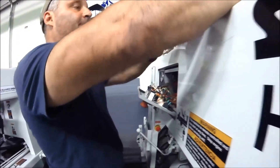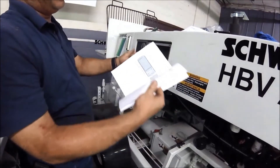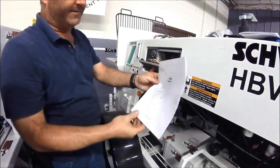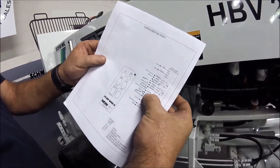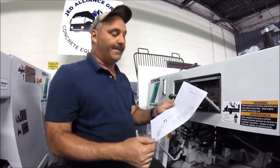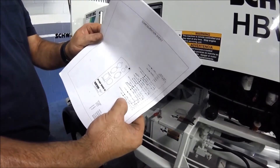If you look in the directions of the book, you're going to see a breakdown sheet. This book is your operating instructions on how to wire it. Each model is different — there's a slight variance — so only if you have rev up and down volume control. In the book you have a sheet, and I just marked it down for you so you could easily reference it. You've got white as your power, green as your pump forward, white and yellow as your power, and then yellow as your reverse. This is just for pump on and off. If you've got rev up and down, now you've got violet you have to energize, tan for increase, pink for volume going down on RPMs, and then brown for your ground. So you'll have to run two grounds.